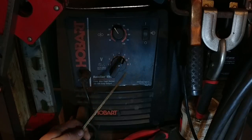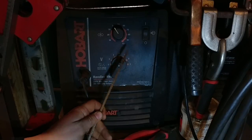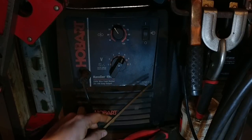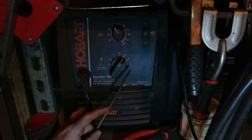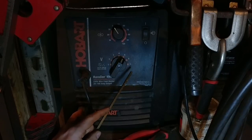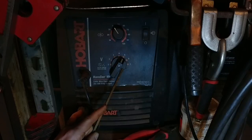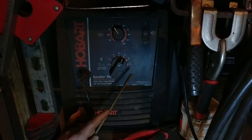As far as run time goes, they say that at roughly the middle of the amp settings — around 150 to 160 amps — you can run this machine for approximately 30 minutes. That's probably true depending on how well you're holding your arc length, which determines the amp draw. In normal use, I can usually get about an hour of welding before I have to let the machine cool down, and it takes a good 20 minutes or so at higher stages before you can start welding again.